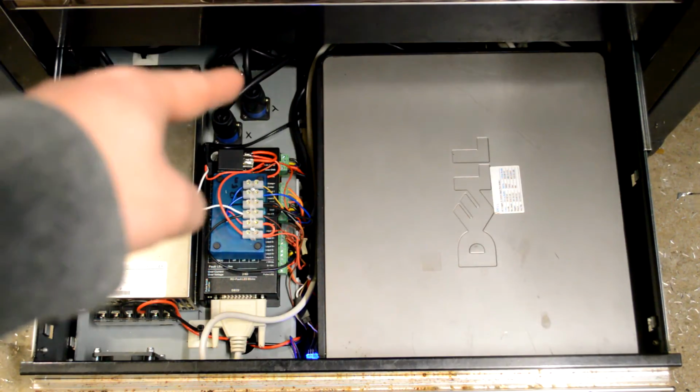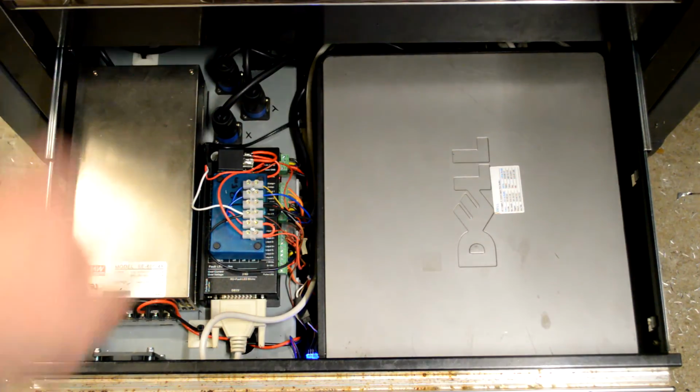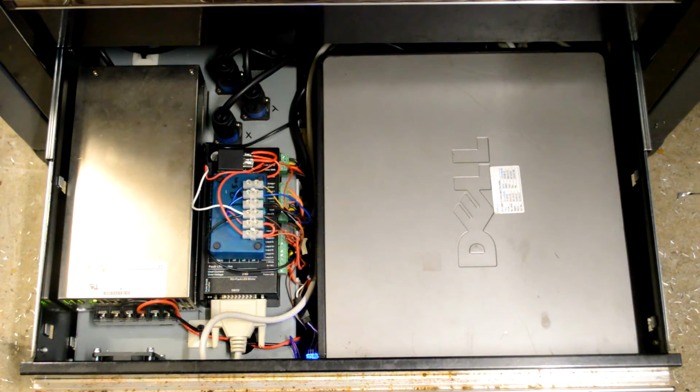Just behind there are the Speakon connectors for all the steppers. There's 4 of them in there in case I wanted to add a 4th axis later, but for now just 3 of them. It bolts to an aluminium subplate. All the electronics go on a subplate, so you can undo the Speakon connectors and just pull it out if you need to do any maintenance or anything like that.